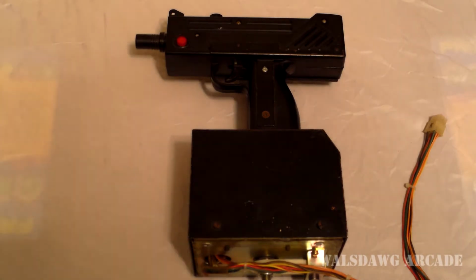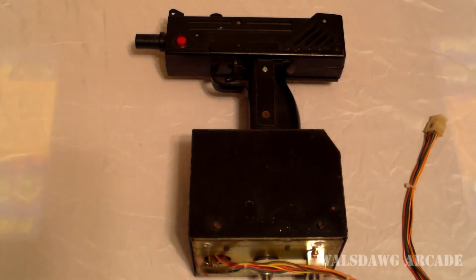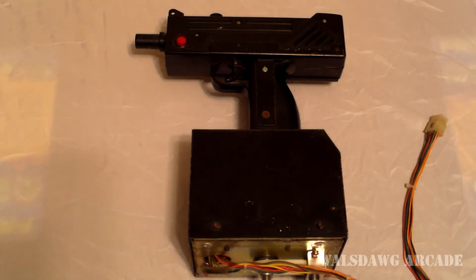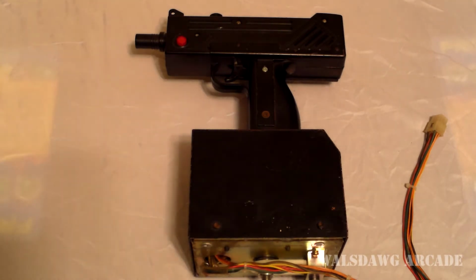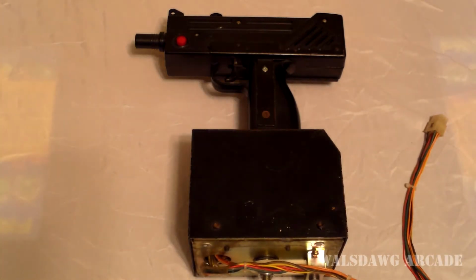Work with my S-JIHP PCB that I also sell. And many of you might know from looking at my other videos that my S-JIHP is a PCB that interfaces with a Sega JVS I/O and allows you to use arcade controls in a home environment. In the case of this one, this is an Operation Thunderbolt gun from directly off a cabinet. It's a positional gun, sometimes called XY.